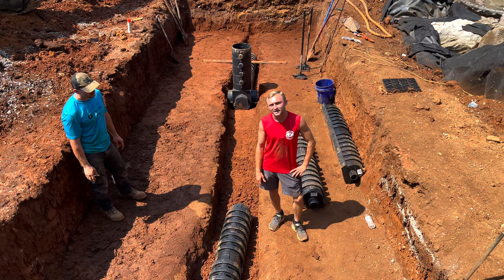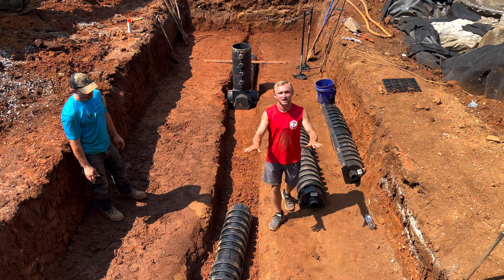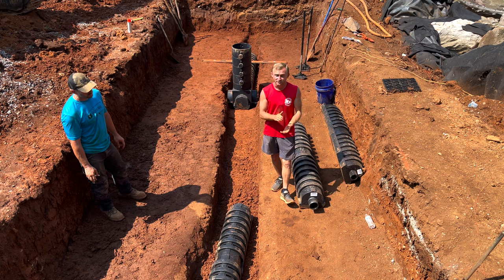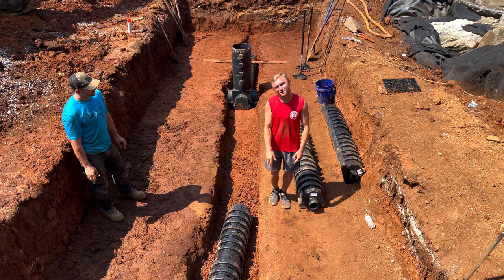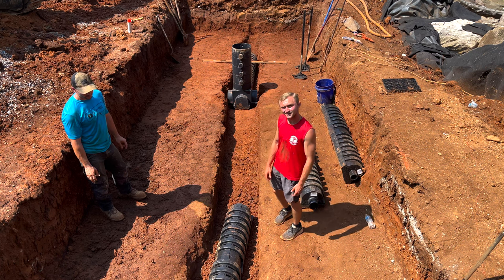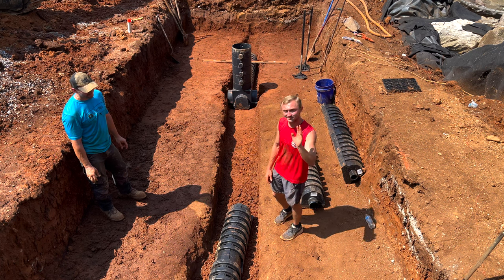And it's already going to be quite a lengthy process to clean this giant wetland filter. So really taking the time to get the bottoms graded out right, to where it all goes to that snorkel for clean out purposes on the front end, is a big thing. Because can you just imagine tearing this wetland out and regrading the bottom? No one's ever gonna do that. They're just gonna spend extra time cleaning that thing out every single year, and it's gonna suck. It's gonna be horrible. Been there, done that, don't do it.